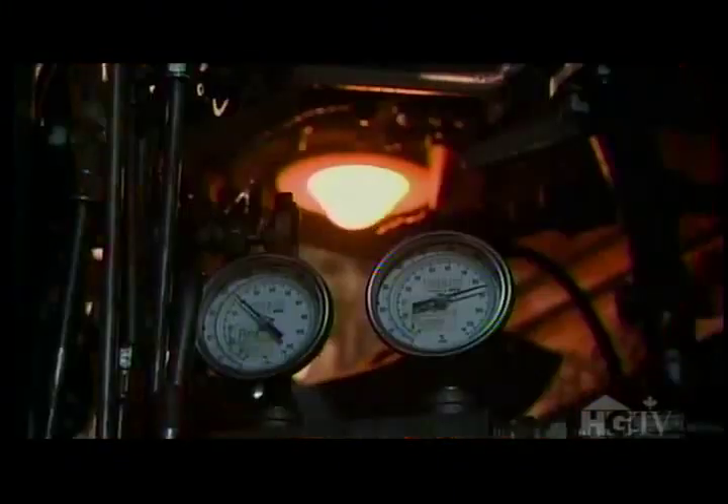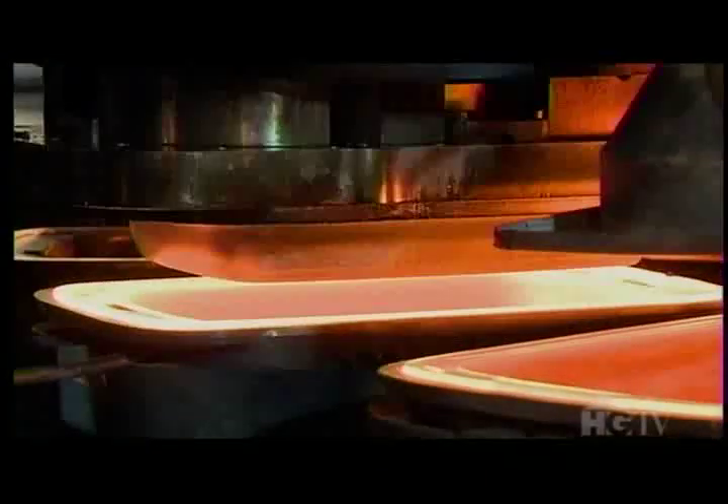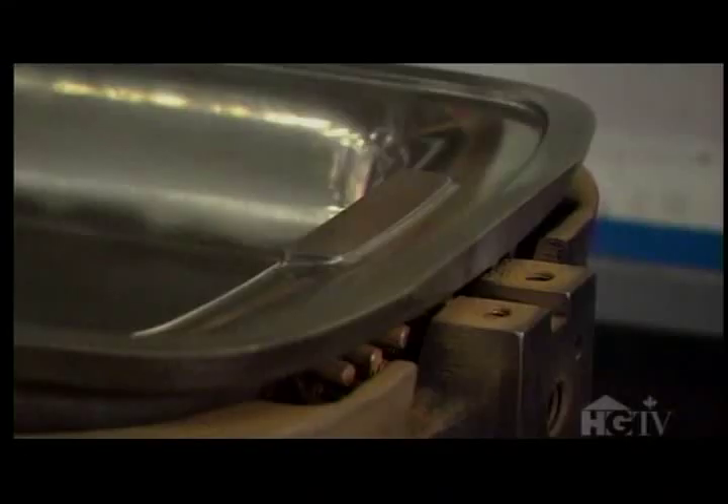Once melted to a red-hot liquid, gobs of molten glass fall down a chute where they land straight into the presses. We press everything that we make — we have 16 molds on a press. The hot glass falls into that mold, and the plunger forces the glass into the shape of the mold, going up and down continually. The biggest challenge in manufacturing the Easy Grab bakeware was the hole in the handle, so we had to refine our equipment and tooling and do many trials to meet the high-quality standards that Pyrex has.